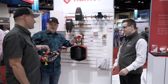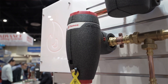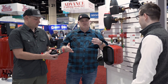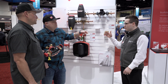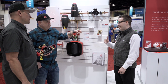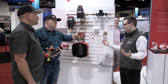So you're telling us that this will be installed on our piping system in place of any other air separation. This particular model will do dirt and air. But we're going to leave this in a commissioned system and we're not flowing all the water through it? Correct. So basically, once you've got all the air and dirt out of the system, once you get through that initial corrosion period it should settle down. At 25%, we're actually getting better performance than some of our other models anyway. And then maybe every six months to a year, you might want to switch it to max mode for a little bit, flush everything out, and then back to eco.